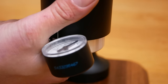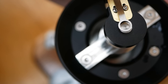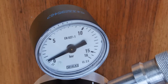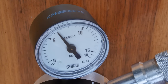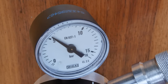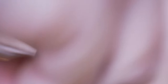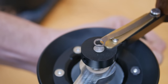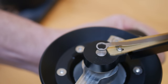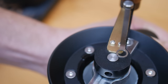So that's temperature — what about pressure? We've filed a patent for this idea, which makes use of the flex in the handles for each of the machines to read out a calibrated pressure. We have developed versions for both the Fulcrum and the Helix. As far as the user is concerned the handles have imperceptible flex, but we've designed the system to accentuate this small amount of flex. The Helix is currently set such that when the ring aligns with the centre of the lead screw, 10 bar pressure is achieved. The calibration of the pressure gauge can be changed to read any desired value, and for those interested we will be making the calibration graphs freely available.